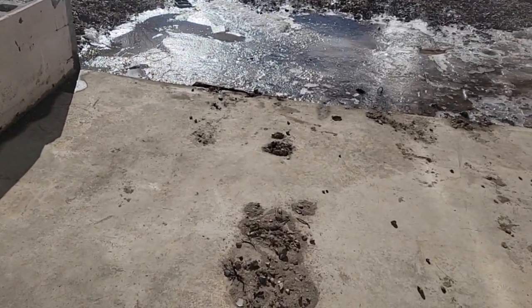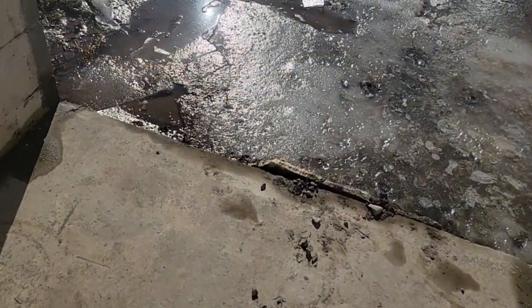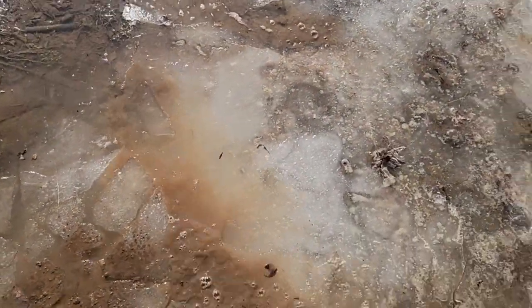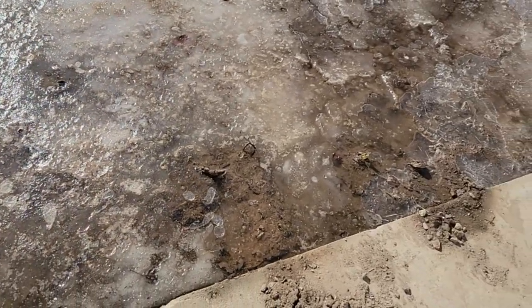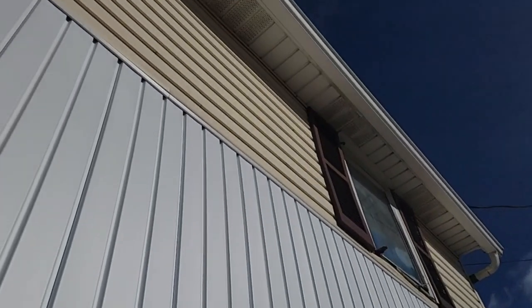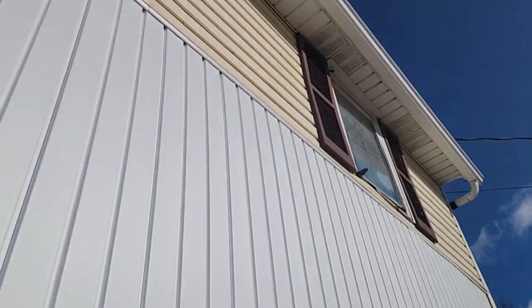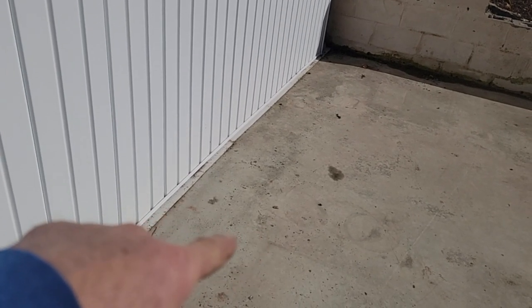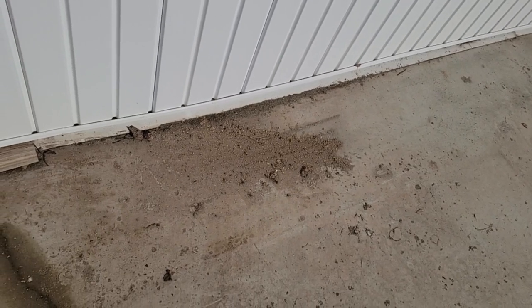This seems to pool up a lot of water right here. And you can see there's a lot of water here, about 6 inches deep. That's probably where we're gonna dump some of that earth. But the water that comes up on this slab, it kind of sits here. And there's a gutter up there that must be plugged because it just runs right over and it hammers right here. And I don't want it to go under the wall. So I think I'll come out a foot anyways. And then I'll drill some holes. And that's right about at the drip point.